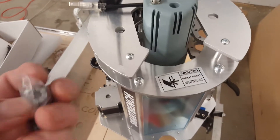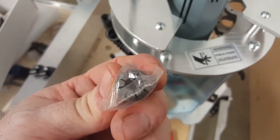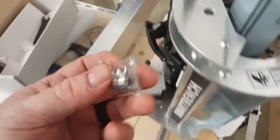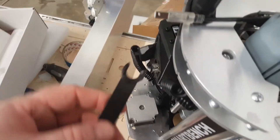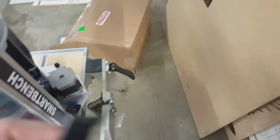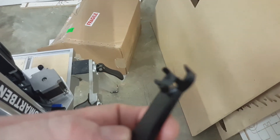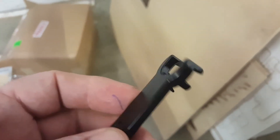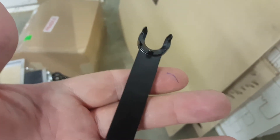In the box is a precision collet, which has a multi-split face and is better balanced than normal collets. The regular collets on the 800-watt just had four splits and worked fine, but this is what they call a precision collet. It's ER16 and uses a special collet wrench to grab onto the end of the collet nut. These are available on the Yeti website — if you misplace this wrench, you can't make collet changes, so keep a spare.